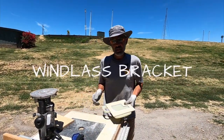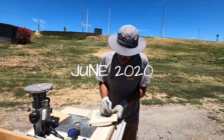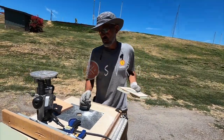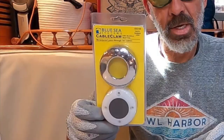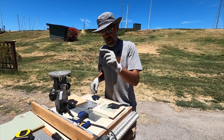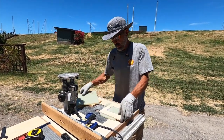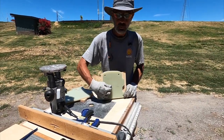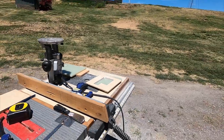What I'm doing now is making that base plate adapter - it's actually just a fiberglass spacer. The whole reason I'm raising this thing up off the stainless platform is to be able to route the cables from the motor up and through that rubber deck gland. I've got the windlass inside to show you, but I'm starting to cut out this adapter plate and hollowing out the middle so I can route the wires that will exit the bottom side.